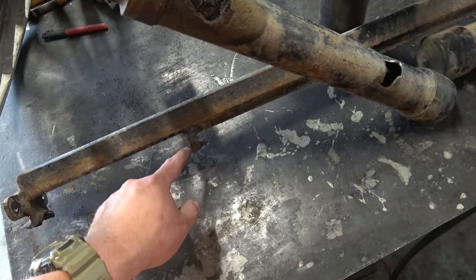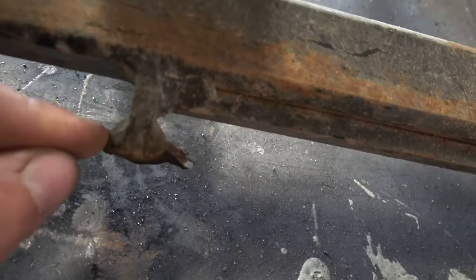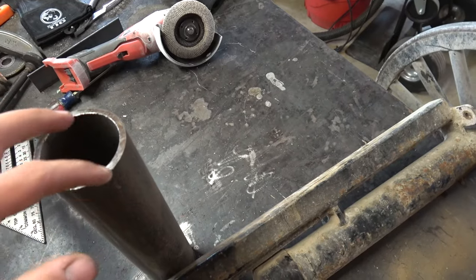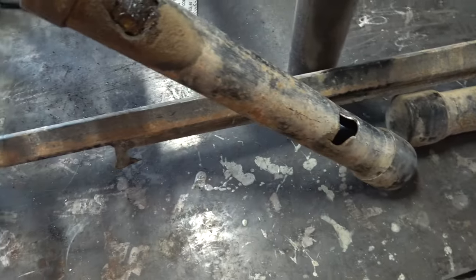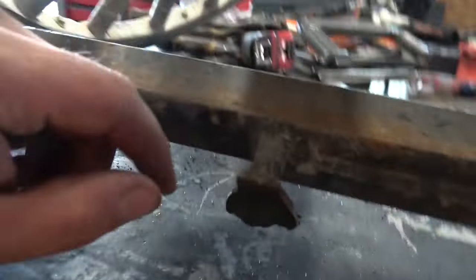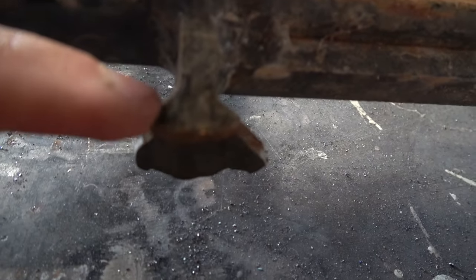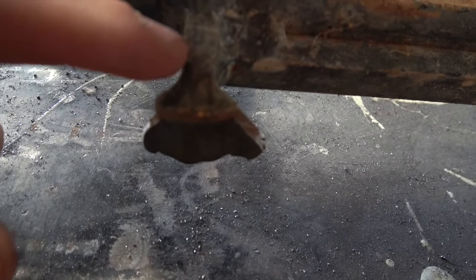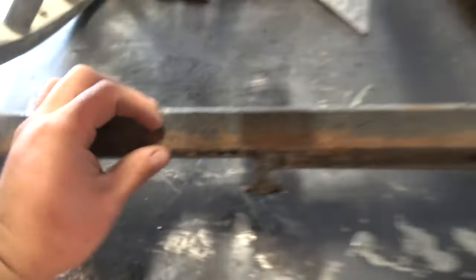So then I'm going to take the flat bar here, and I'm going to try my best to slice off just above the original weld, and that should slice off enough material to cover what new material I'm adding on. Because the original metal comes to about here. The weld goes into the base, this plate, a little bit further than the original metal. So if I slice this, I'm going to get a score here. Hold on.